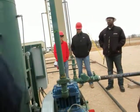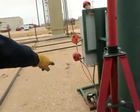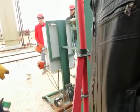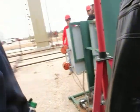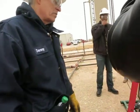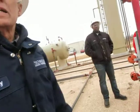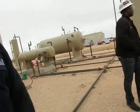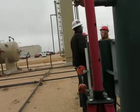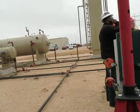The liquid that comes out of the scrubber would be tied to a little circulating pump. Mm-hmm. And the circulating pump would take it back somewhere where it could get pumped in the system again. Okay, Mr. Blair. To there or straight into your tanks? I'd probably want to put it through the system. Oh, so that in case there's water. Yeah. So the gas that was liberated from our vertical is a lot richer than the gas over here. Okay. Do we just sell them the same? Yeah.